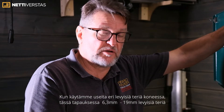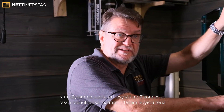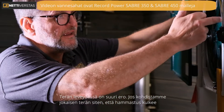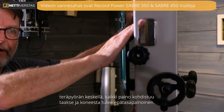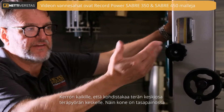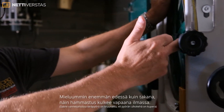When putting a range of blades on — from a quarter inch up to three-quarter inch, which is 19 millimeters — there's a big difference in blade width. If you track them all with the gullet to the tooth in the center of the wheel, all the weight is at the back, making it an unbalanced machine. You want the blade in the center of the wheel so it becomes a balanced machine.